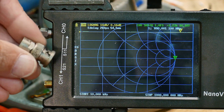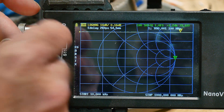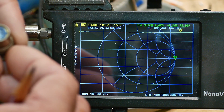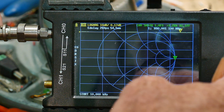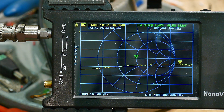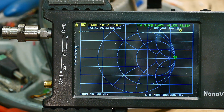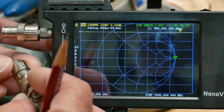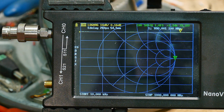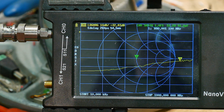The next one I just found in my bin today — it has a little label and is marked HP with part number 11652-60000. Put that on here — yowza, it's about the same, really really good. These two may have been made by the same company. I'll definitely save those two for calibration use. The last one I don't know the vintage of, but it's marked King's connector — I'm a real fan of Kings, they're here in California. Bang, it's perfect too. So I've got three that are really really good.